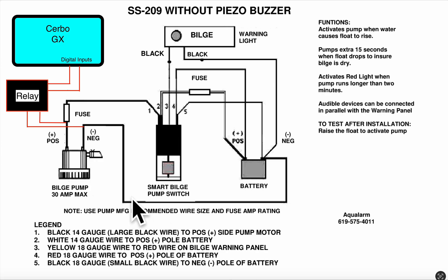The simple answer is that the relay needs to be located — specifically, the 12-volt input to the relay needs to be located on the switched side of the bilge pump circuit.